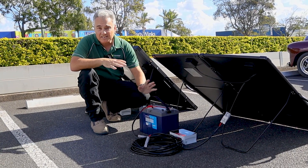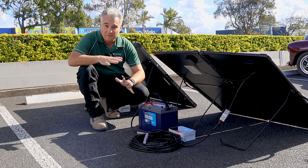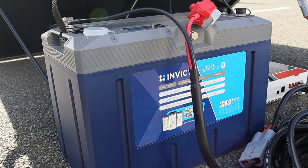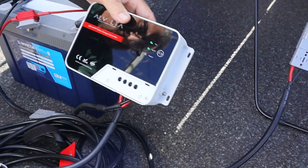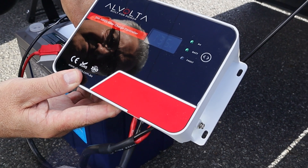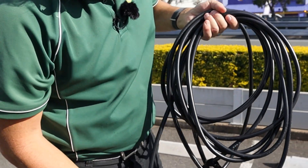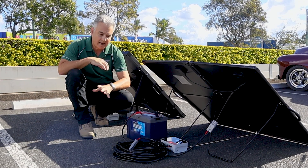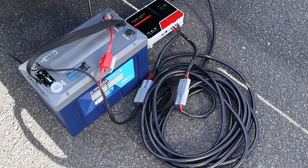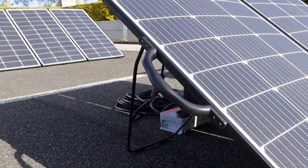Just a little bit about the details of our test today to make sure it's as fair and equal as possible. Every system has exactly the same battery — a 100 amp Invicta lithium battery. We all have a high quality Alvolta MPPT regulator: the 220 and 200 have 20 amp regulators, but the 440 has a 30 amp. They're all the same brand. We've also got the same cabling kit — a 10 metre lead with six millimetre square cable — and we're running through that cable to give an accurate assessment of each solar panel kit.